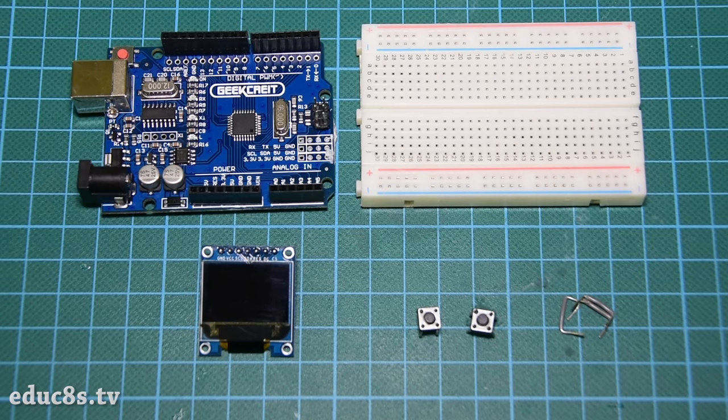Let's start! The parts needed in order to build this project are the following: an Arduino Uno, Nano, Mini or Mega, a 0.96-inch color OLED display, a breadboard, two buttons and some wires. The cost of the project is around $15. You can find links for all the parts I use in the description of the video below.